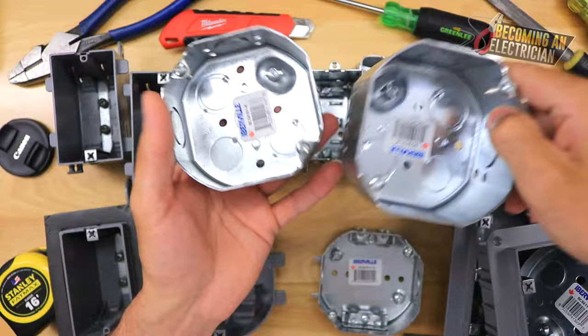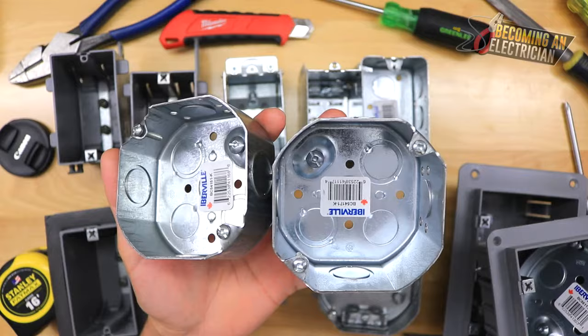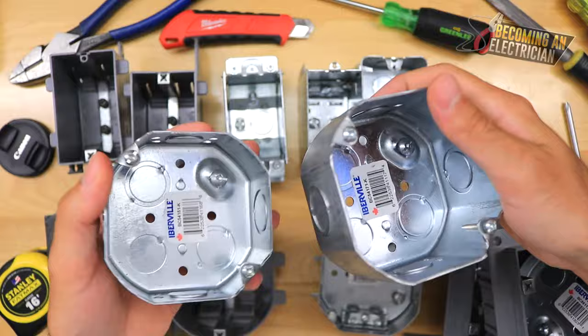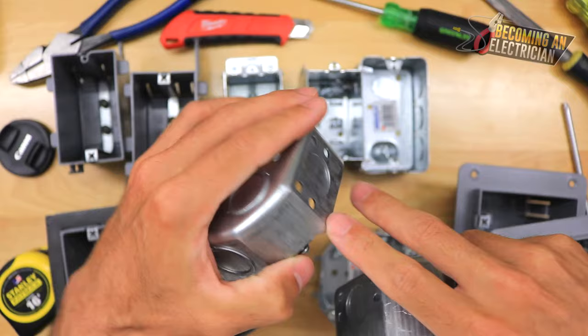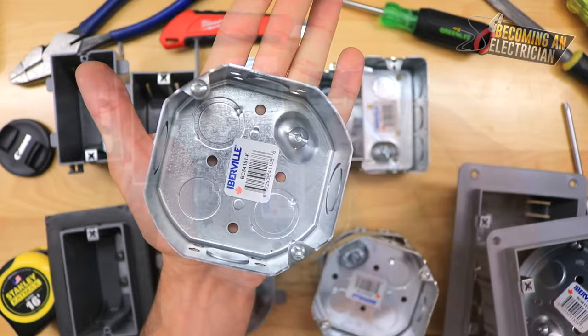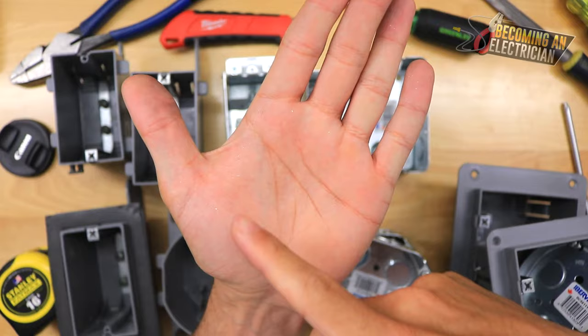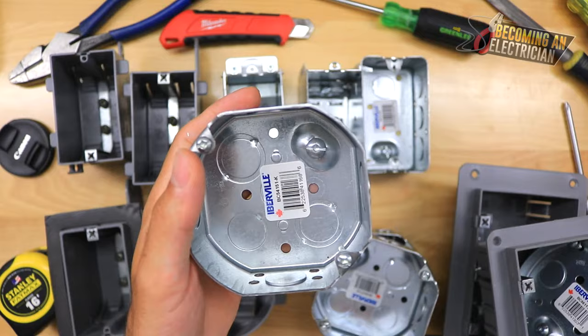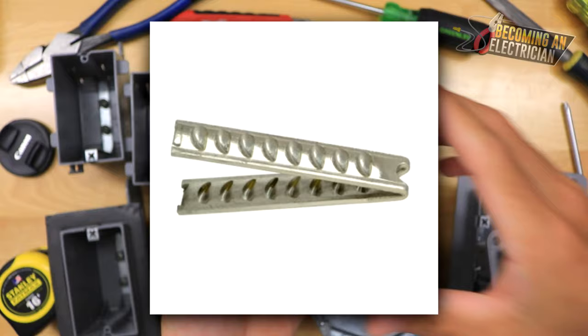In a commercial setting, depending on where you're mounting, many octagon boxes have a strap on them which makes mounting really easy and secure. The strapless ones require screws through the box, and sometimes they don't go in well and things get loose. Typically you'd use strapless ones on concrete — mark it with a sharpie, hammer drill it, put in your anchors. I recommend Alex Anchors — aluminum expansion anchors — over blue inserts, which don't hold very well.